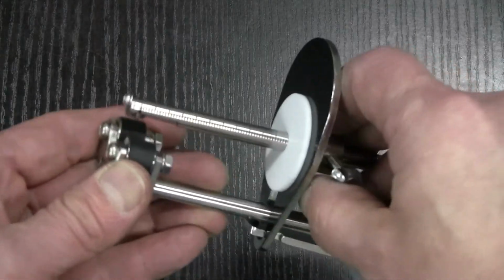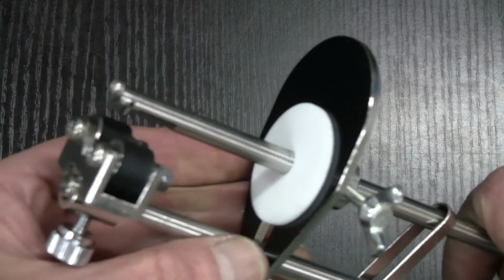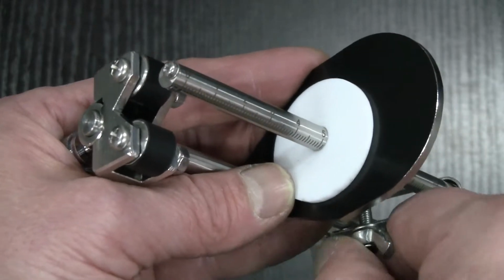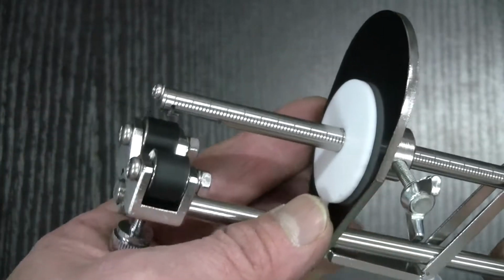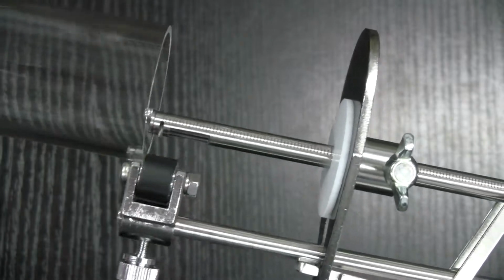2. To make a cut, set the depth of cut using the convenient length marks on the arm to align the cutting wheel to the required finished length. Securely lock the back plate with the thumb screw. For cuts less than 50 mm (2 inches) deep, remove one of the 2 guide rollers. Longer cuts are easier with both guide rollers in place.